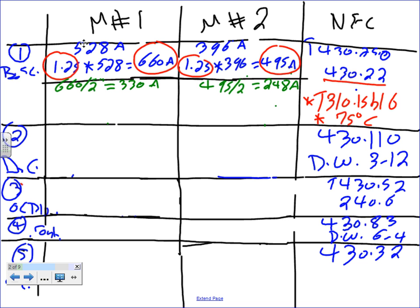So I'm going to have two sets of how many conductors and why? Three conductors. Do I need a neutral? No. No neutral with three-phase motors for the most part. So two runs of three conductors, each one of them 400 kcmil. And what type of insulation, Chad, do I use?